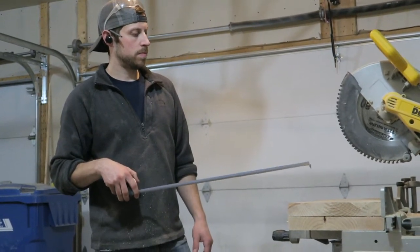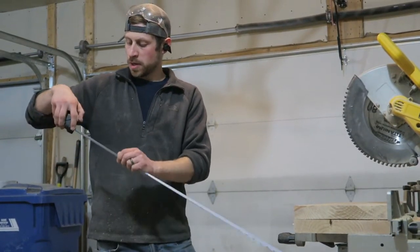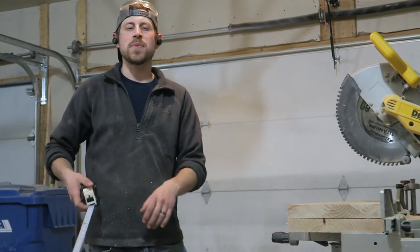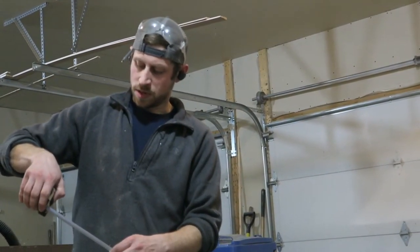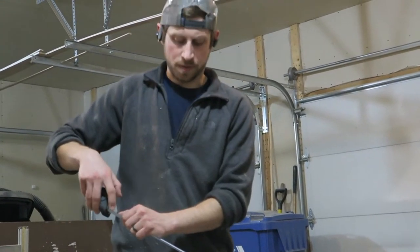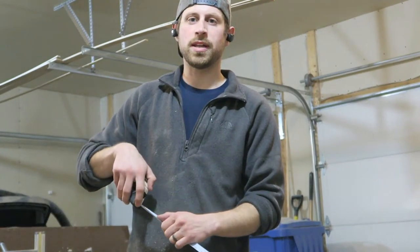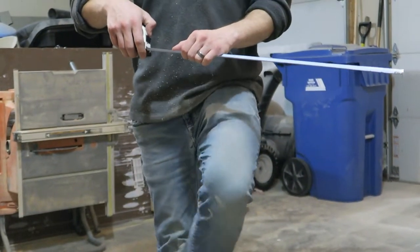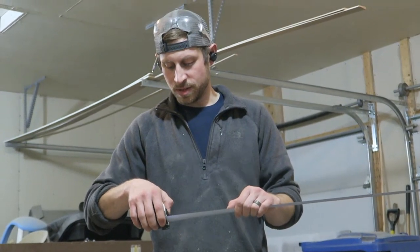We had a little bit of, what do you want to call it, a hiccup on the height of the table. So we were originally going to go with 32, but 32 seems a little bit high. It just depends on the chair you have. If you're going to have a normal sitting chair, you're going to be at about 24 inches where the top of your leg sits when you're sitting down. So you want enough room to move your knees around, and my wife likes to sit cross-legged in all sorts of weird positions when she eats at the dining table. So we have to adjust that a little bit so she has that leg room. She can go like this, and like this. Whatever way you want to sit. So anyways, long story short, we're gonna cut it down to about 28 3/4.